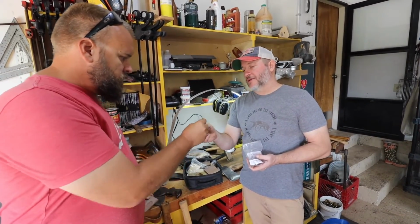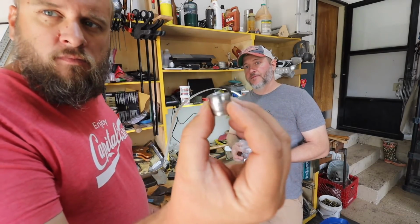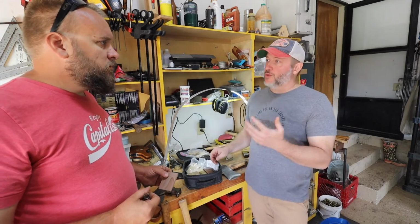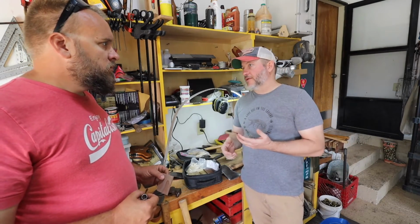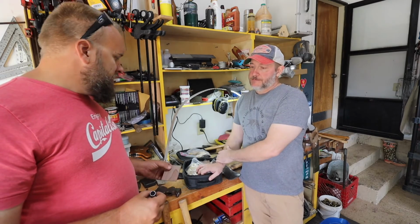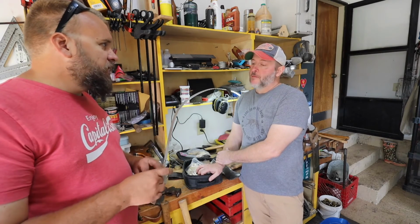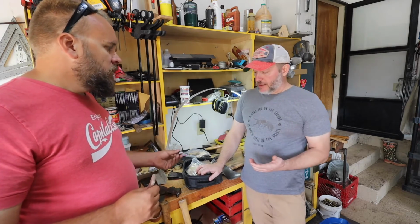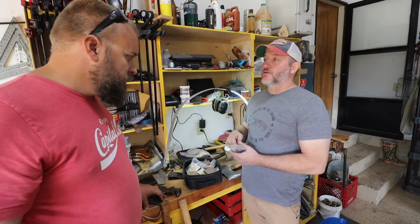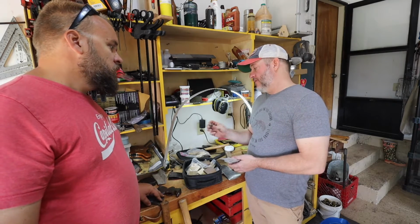So I very rarely use barrel wedges because really if you're wedging a handle with a wooden wedge and you're doing it correctly, you shouldn't need to put a metal wedge in it. There should be no need for it. I kind of thought that you always did just automatically put in the wood wedge and then a metal wedge, but not really. No. If it's done correctly, the only time you should really put any other wedge in is if something's going wrong. If the head's gotten loose, if something else is going on. And these are a cheap fix.